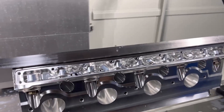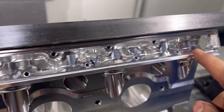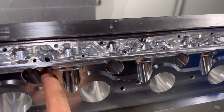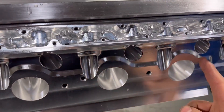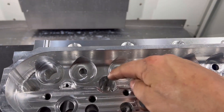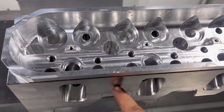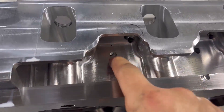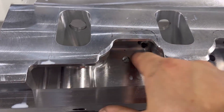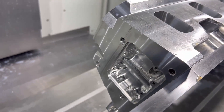Part three update: we've been working on the water jacketing all through the top side — actually under the exhaust. Water goes in here, circulates through, then crosses up and over in between the exhaust ports and spark plug, and comes up through this passage. It actually comes through here, then comes down to this side. There's the feed hole from up and over. We still need to cut all this out and pocket the insides for the water jacketing, and then those holes go to the ends.